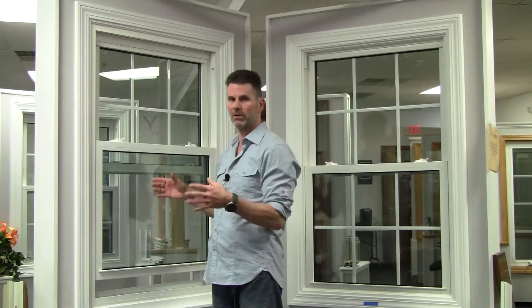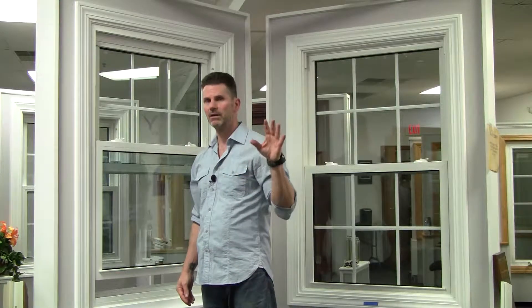This just has to do with the proper way to tilt them in. You have to remember the bigger the window gets, the more the glass weighs. Triple pane glass is awesome — it does have some limitations on sizes, but it has to be pretty darn big, like 25 square feet. So whether this is double pane or triple pane, here's how I would tilt this window in to be safe about it.